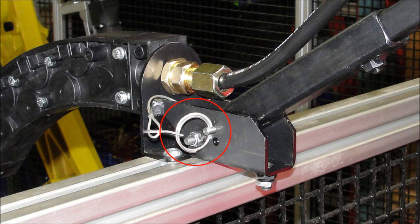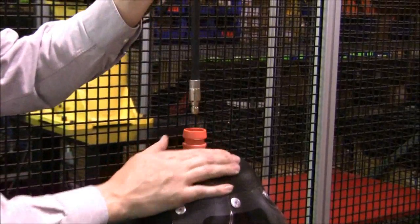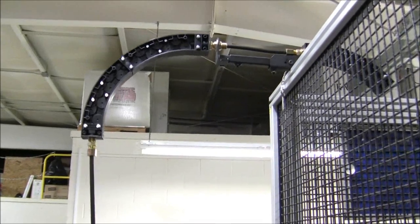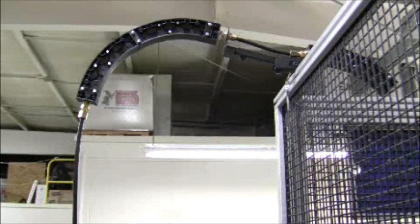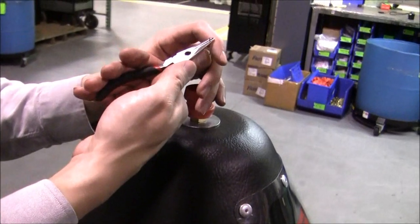Each adjustable arm includes a locking pin and hinge point that allows an operator to raise and lower the arm during a wire changeout. A conduit is normally run vertically from the drum cover quick disconnect and is attached to a guide module. During a wire changeout, the operator simply disconnects the quick disconnect at the drum point, removes the locking pin, raises the arm, and replaces the locking pin to hold it up and allow a quick and easy wire changeout. Upon starting the wire into the conduit, the operator can lower the extension arm and lock the conduit back into the quick disconnect at the drum cover.